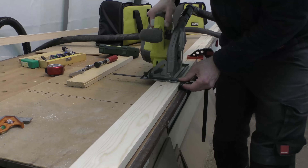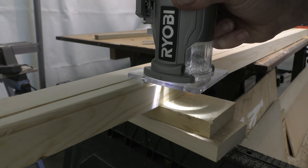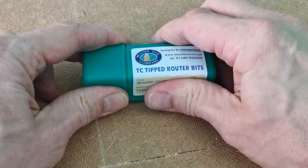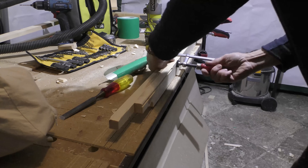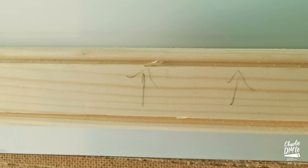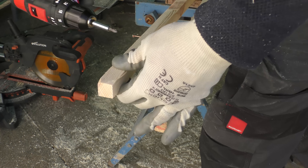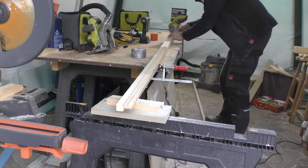With the strips cut down to size it was time to route the decorative edge. My half-inch shank DeWalt router is just too big and heavy for something delicate like this, so that's where my quarter-inch shank Ryobi trim router comes in — it's been a DIY game-changer for rebating hinges, cutting grooves for lighting, and now the fascias. I bought a beaded-edge quarter-inch shank router bit from Wilden Tools. I made a few early mistakes — each time I stopped to reset my clamps the slightest movement produced a jar in the edge. I minimised this by screwing a piece to the back of each fascia to create an immovable bed, and clamping along the length so I didn't have to keep stopping to reposition clamps.